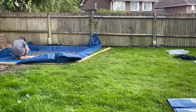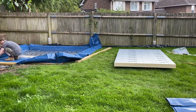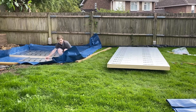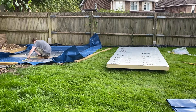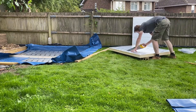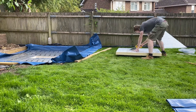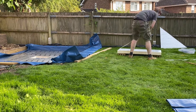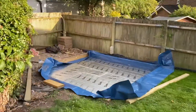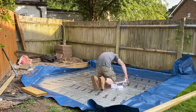One of the reasons I'm using a concrete base in my build is to maximise the available ceiling height due to the height restrictions on the overall building set under permitted works. So by having a concrete floor I can get the floor level of the building as close to ground level as I need. So now what I'm doing here is fitting some Quinn-therm 75 millimetre thick insulation underneath this concrete base so that it's nice and insulated and I do not lose any height in the ceiling. In fact, this is a common technique used in construction of most new homes these days.